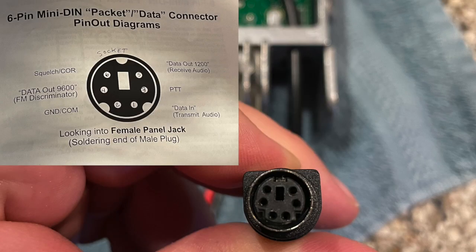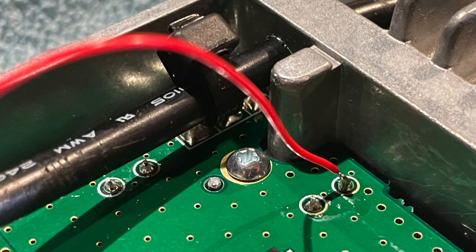One of the most difficult aspects of building this cable is to figure out what wires you need to go where. So if you have an ohm meter, I encourage you to take all the wires from your cable after you've stripped it and figure out, using this chart, what color is what pin on your wire, and we'll go from there. Once you've drilled your hole and stripped your wires, run the cable through with at least 6 to 8 inches of bare wire available inside the radio. I used a zip tie to prevent the cord from pulling back through as a strain relief.